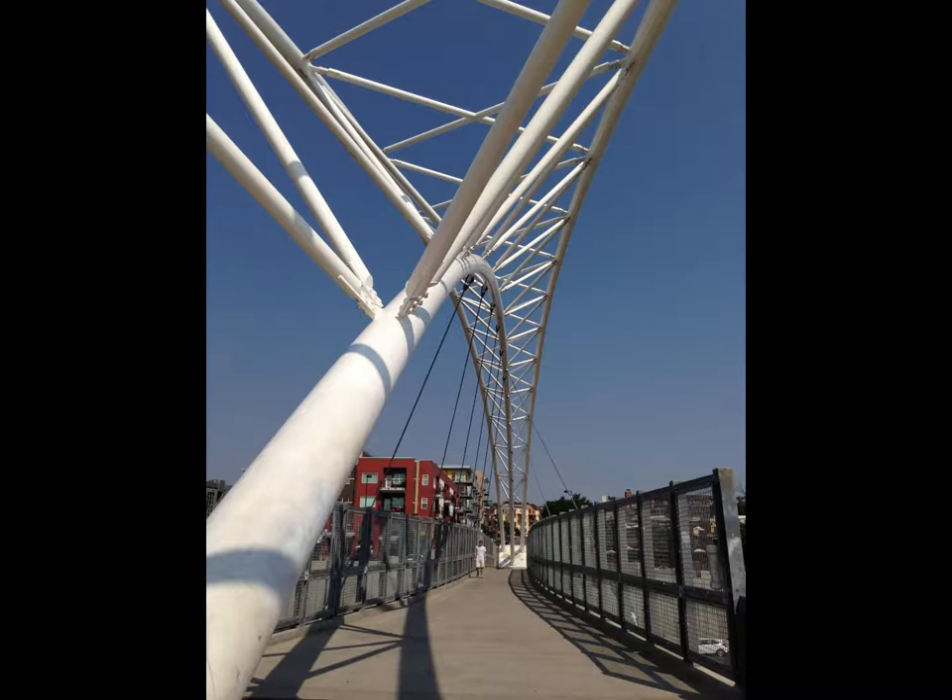The effect of those two things is to introduce a twist or deformation, because these elements are pulling to the left while these elements are pulling to the right. So this member right here is being pulled to the left on this side of the bridge and then pulled to the right on the other side. There is no structural logic to doing that — it's introducing a torsional deformation in the arch which normally we'd like to avoid. However, because we've made this arch very strong torsionally, we can get away with playing these kinds of games. Certain designers like bridges with an asymmetry or odd rhythm that captures your attention.